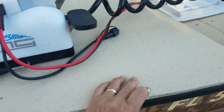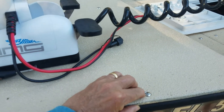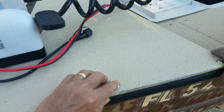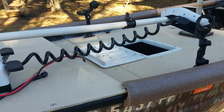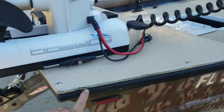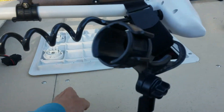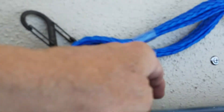Mounted everything with stainless steel screws and little rounded washers — gives it a dressed look. William, that's one of your ideas. Looks really nice and it's held up well in salt water. Everything is sealed with clear silicone — all around here, anything you see, also here, and the hatch edges down through here. You can see the silicone there.